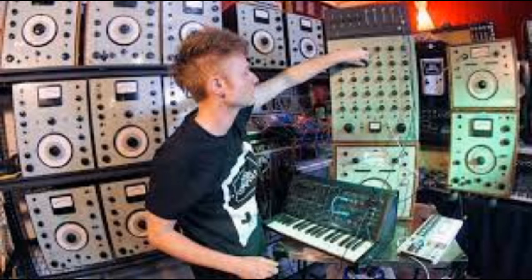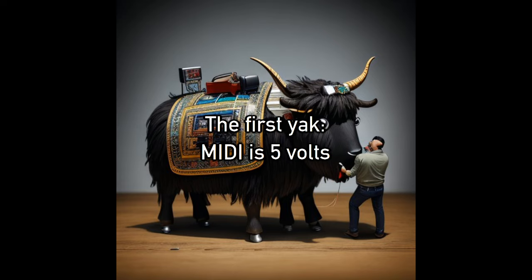I don't have any fancy test equipment in a hole in a wall somewhere in my studio. Well, I do have a 96 kHz audio interface, and that's not particularly impressive, but recording the MIDI signals to WAV files, I should be able to measure things with an accuracy of up to 1/96th millisecond. Well, it's hard to say, 96th. That's about 10 microseconds, and that's good enough.